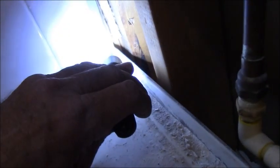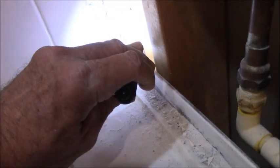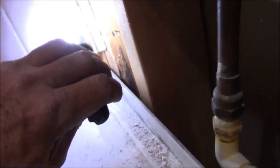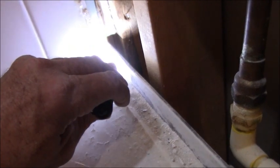I have an excellent view of the wallboard. The wallboard I was trying to show you — when I explained before about setting wallboard inside and on top of the edge instead of the top of the lip — this is a very, very good example of what I'm talking about. You see how, even though this is greenboard, you see how rotted it is at the bottom. It's just absorbed water over the years, over and over and over. And it begets mold and mildew.